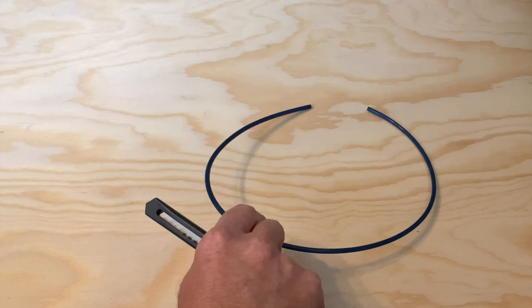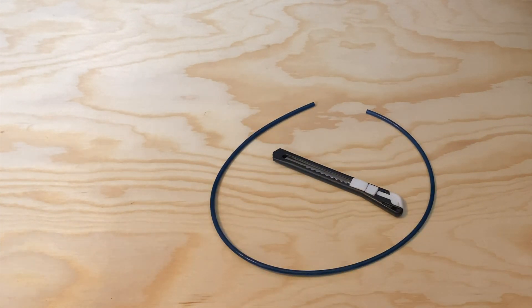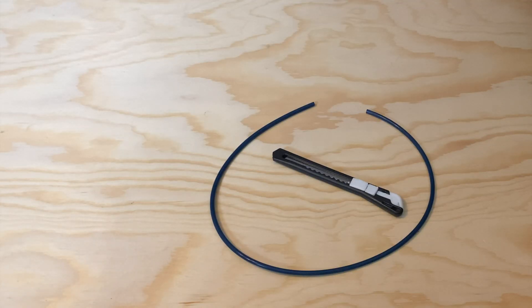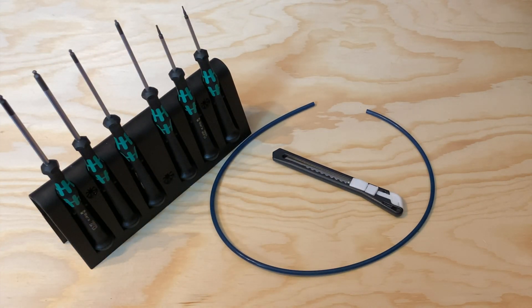Before starting, we need to have a bit of PTFE tubing on hand, as well as either a razor blade or a thin utility knife so you can cut the tubing flush with the guide. If you need some Bowden tubing or a utility knife, I've got links in the description to these on Amazon. There are links to plain generic PTFE tubing, and if you want the good stuff, there's a link to the Capricorn PTFE tubing, which is what I'm going to use. You'll also need the ball-end hex wrenches which came with the SV-01, or your favorite set of hex wrenches.